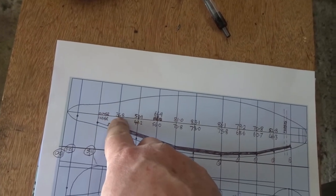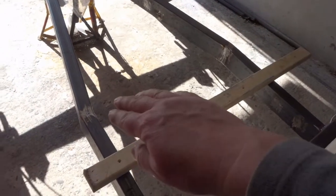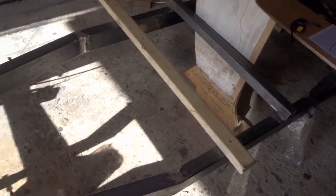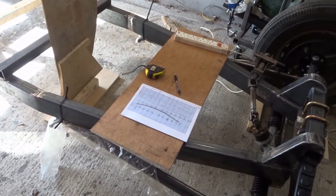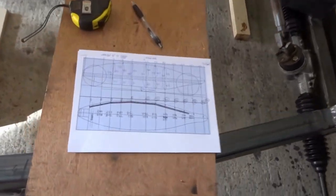The outer to outer measurement is 36.8 centimeters. The reason I need to know that is I'm going to cut in MDF a set of semicircle crescents — so they're like half the belly tank cross-sections — a foot apart all the way along, apart from the stretched bit. I'm going to actually slot them into the actual frame. I'm not going to make a separate wooden model because it takes too much room and I haven't really got the space. I'm going to slot them in, string them together with a few flexible pieces between them, and make my aluminium body based on that. I'll see if I can get those laser cut.